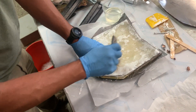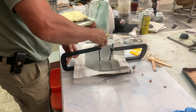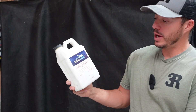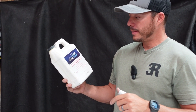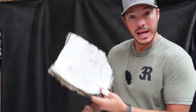We used some clamps to press out any excess resin. I should mention I just used a little two-inch chip brush to apply the resin. As I added the 10 layers of S-glass I tried to use as little epoxy resin as possible. When done, I pressed it: I put a thin layer of parchment paper, then the sheet metal, and used about six or eight clamps and applied pressure until resin started flowing out. For resin we used TotalBoat with the slow hardener — it's epoxy resin and with multiple layers the slow hardener is a lot easier to work with.